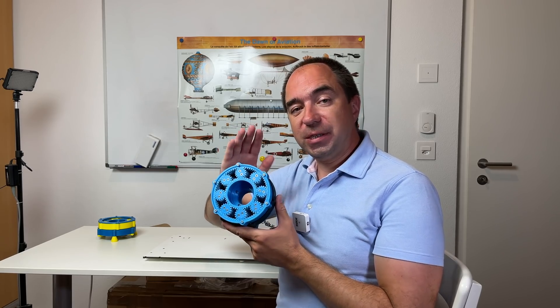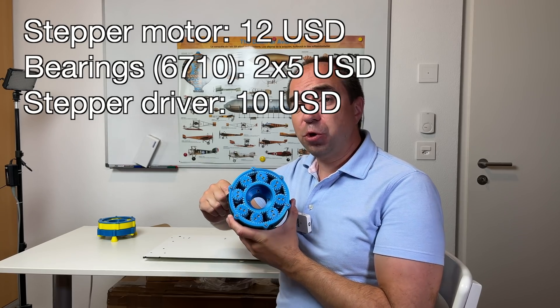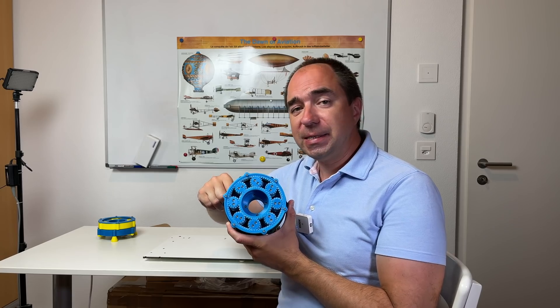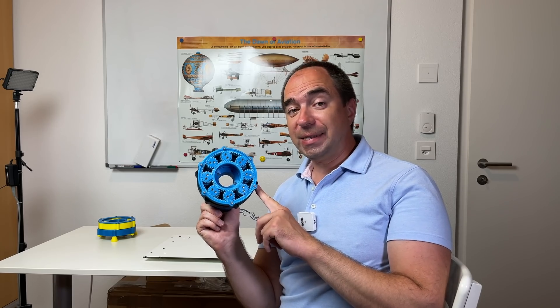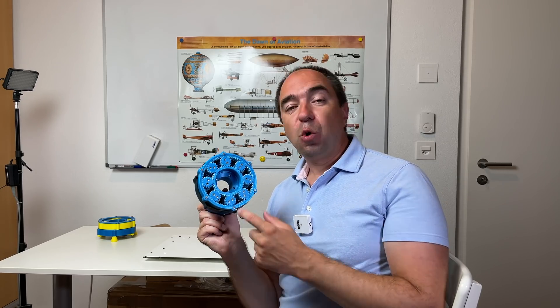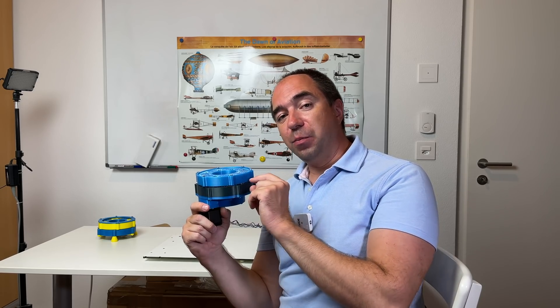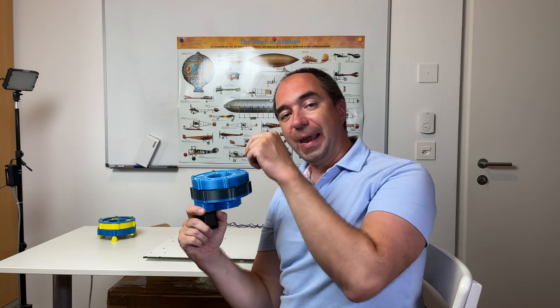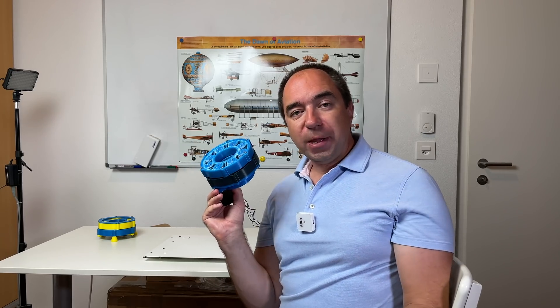Another great advantage is price. This stepper motor is $12, $5 for each bearing, and you can use a driver from a 3D printer to drive it — so the total cost of this actuator is around $32. It's also a hollow shaft actuator with a huge hole where you can pass cables or put a slip ring. For my next iteration I'm going to add a 3D-printed slip bearing between the two rings to improve axial load capability. If you have one actuator for $32, seven actuators is $224 — so a robot arm for $224, which is really nice, with some backlash but a great price.